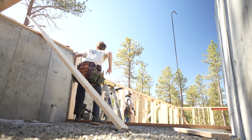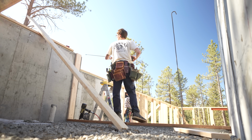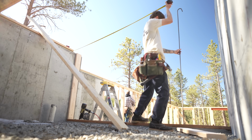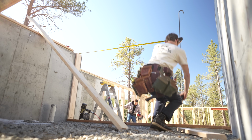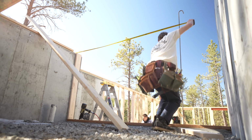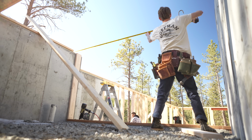Right, that end stud. So my stair hole is 10'5.5" and back is where our beam goes. So let's see where that puts us. 10'5.5" and back. We're just gonna miss this thing, which is sick. Yeah, keep holding me there, Derek, and I'll set my laser here. All right, where are you at? Laser. Okay, I'm exactly 10'5". So I want to be 10'5.5". A little more money. Well, here, let me just check it while I'm standing to make sure. Yeah, perfect.